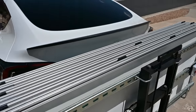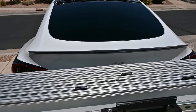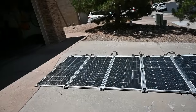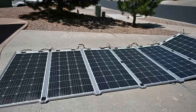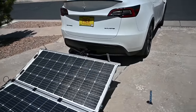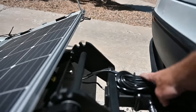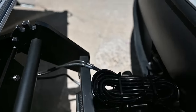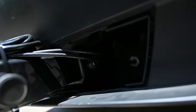Those two panels connect in series with these six panels. The reason I needed that many panels is because you have to have a certain amount of voltage with the inverter — it's above 120 volts before it actually starts operating efficiently. Now that all the PV panels are laid out, you can see the six panels in series, all connected on that side. The additional PV panels are on the roof. In the tailgate we've got some tailgate wiring and PV wiring right here.